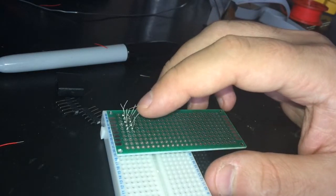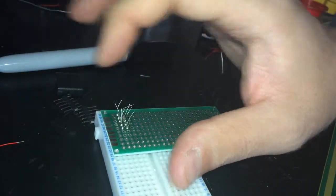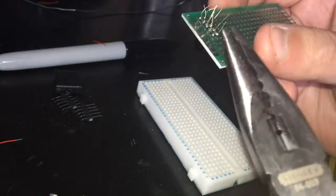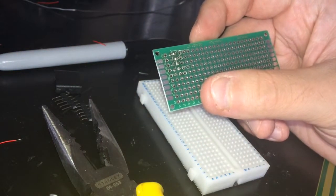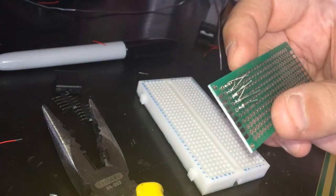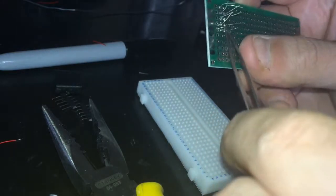And now what you need to do is to get those wires curved and put into those holes adjacent to the holes that you have just soldered. You would need to use needle nose pliers to do that. Unfortunately, I do not have the small needle nose pliers. Security controller at the Heathrow airport has taken those from me. Don't ask me why. So instead, I would use this. There we go.